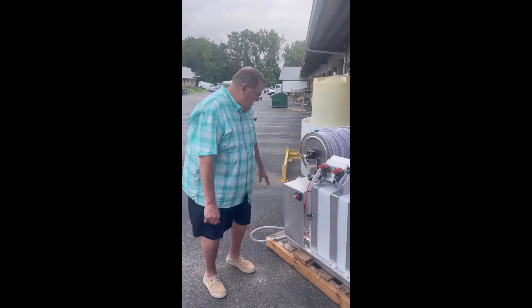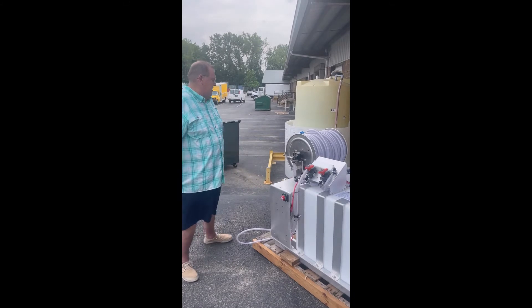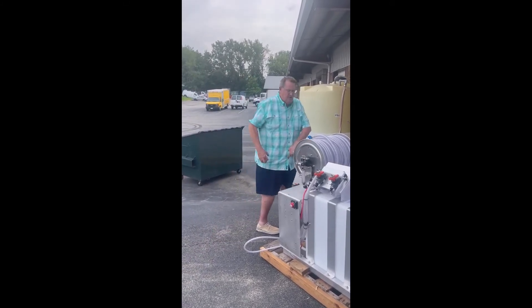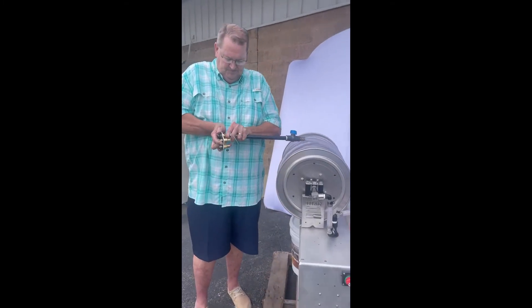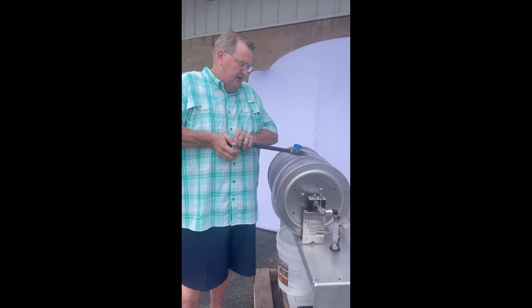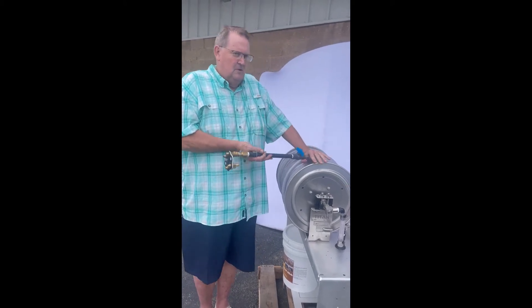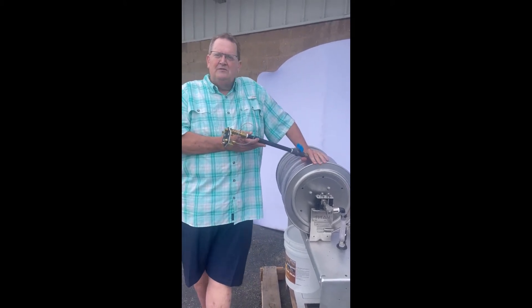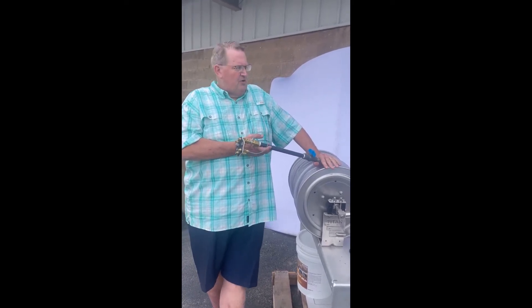Our machine is set to go. We reach down here, turn on our pump, and we're ready to go. We come over to our gun and pick our rinse nozzle and spray nozzle. At the tip, we prefer to use a 25 to 50-degree angle to spray with, and that's going to give us the solution delivery to the house and cover quite a big area.